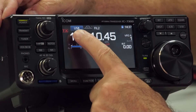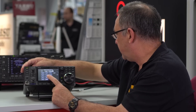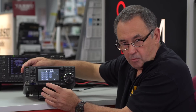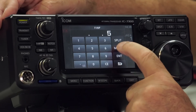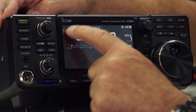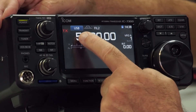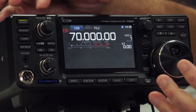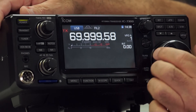If you want to change frequency, you just touch the main megahertz part and it gives you all the main ham bands that are available. It doesn't show 5 MHz or 70 MHz because they're not globally utilised bands. So if you want to use those bands, you use the frequency input button and just type in 5, enter — and now you're on 5 MHz. You have to tune into the appropriate part of the band and then you'll see the TX light illuminate. Similarly, frequency input, 70, enter — now we're on 70 MHz. You can store these in memory if you want to for later recall.